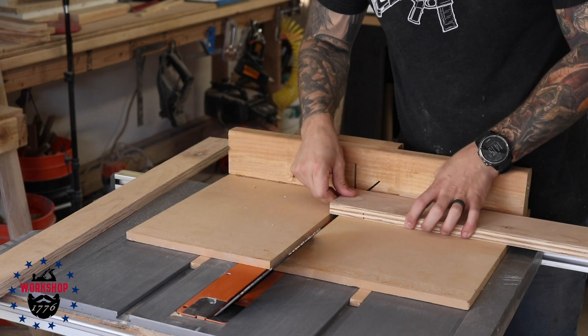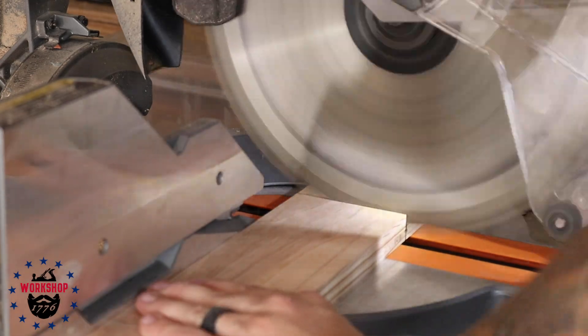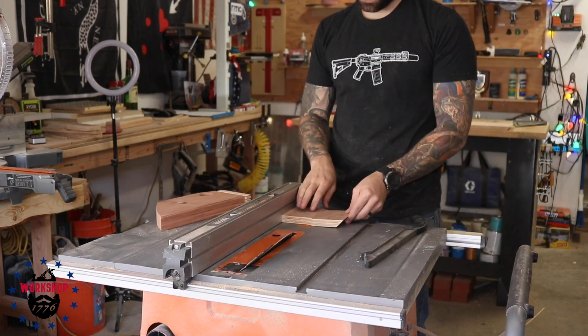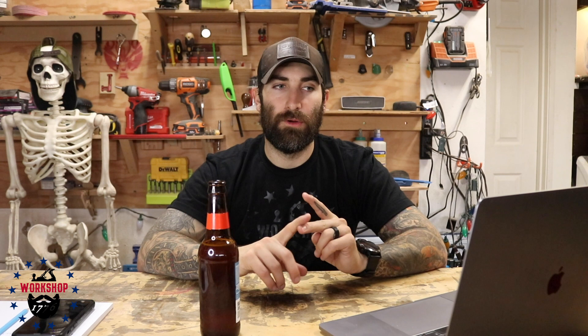For the longer pieces I used my crosscut sled because it's safer than just trying to push them through — I didn't want it to get bound up, especially on the end like that. For the little tiny end caps, because of the way this thing is, there are end caps with bevels on all four sides that just plop onto the side. This was really sketchy. I couldn't think of a better way to do it. Maybe use your miter saw, or a safer option is if you have a band saw, cant your table at 45 degrees and push them through that way — even if it gets bound up it's not going to kick back. But I felt okay doing it so I went with it. I would recommend using your miter saw or band saw for these really small pieces.